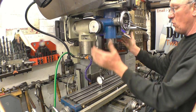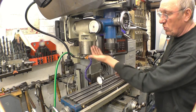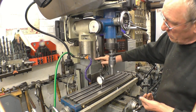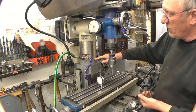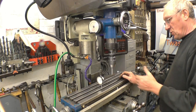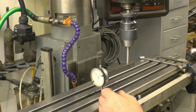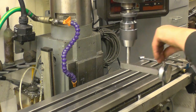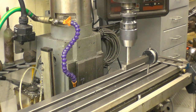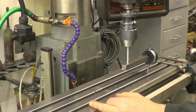It's adjustable quite easily this way and that way - it's got lock nuts on there. You can adjust what they call the NOD - that's adjusted by putting little bits of brass shim underneath there, which I did quite a while ago. That one doesn't move; it's this one that can move. I've got a dial gauge on there showing zero. All I do is turn it round to the other side, bring it down, and it's showing two thou. So this side here is two thou high - that side of the table is two thou higher than it is there.